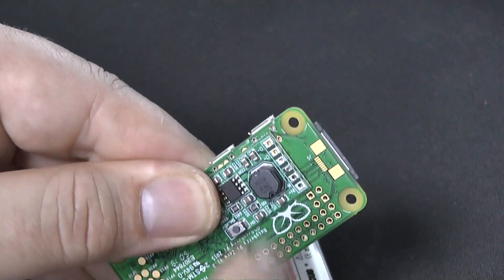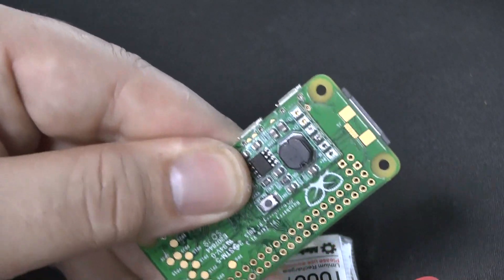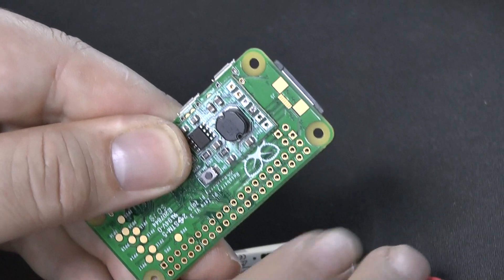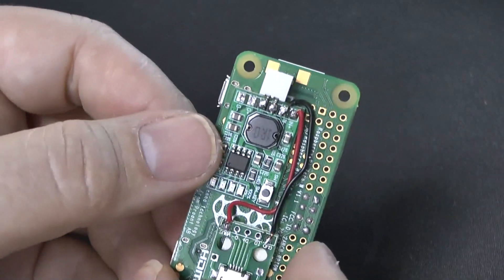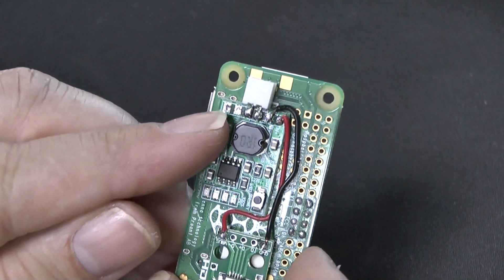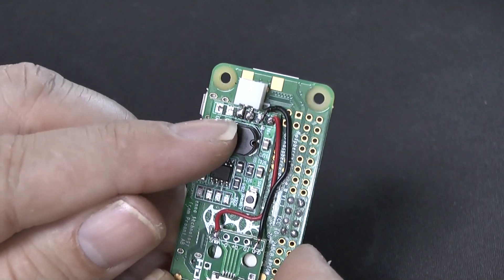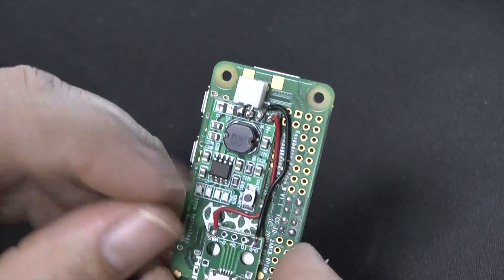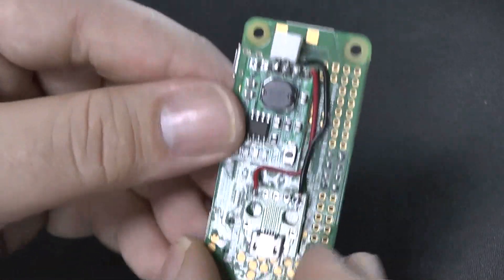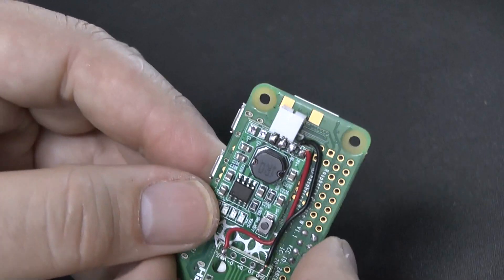Those are the two pads I can then attach my lithium-ion battery and a little connector. So I'm just going to show you that now, with one I made a bit earlier. Here it is — we attached that board and soldered the two pads at the top, which connected to the Raspberry Pi behind. We also attached a little connector which allows me to plug in a lithium-ion battery, and I put two wires down to a micro USB connector, which allows me to charge and also power my device at the same time.